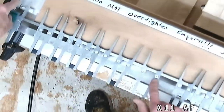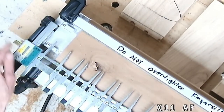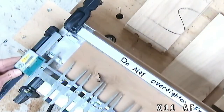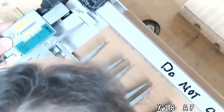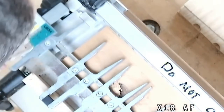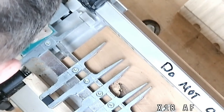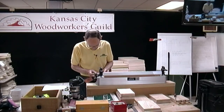support brackets that the finger assembly mounts on, and I shouldn't have racked that the way I did. Can you see that mark? Yes. That's the mark that you're going to align your 3/4 inch scale to. So avoiding parallax at all cost, I'm going to look straight down on my scale on both ends and set it at 3/4 inch.